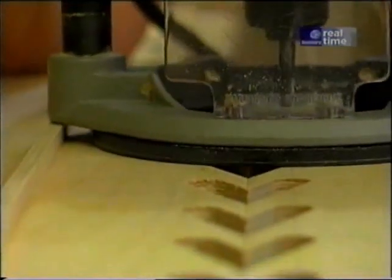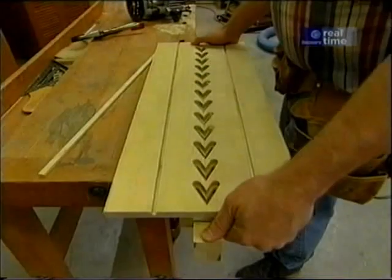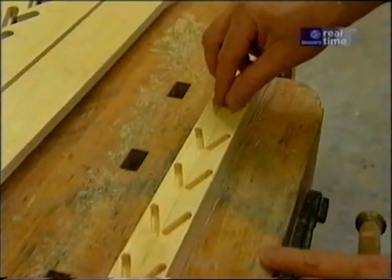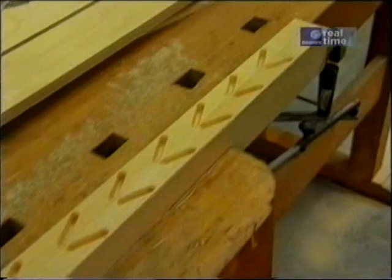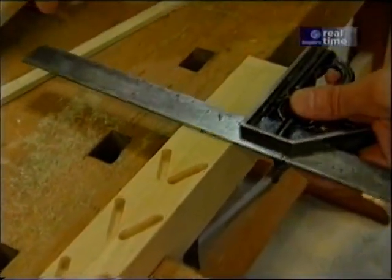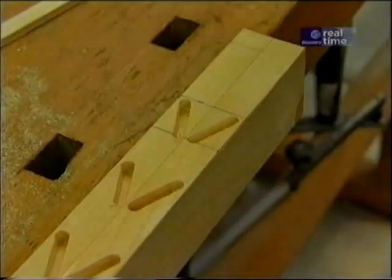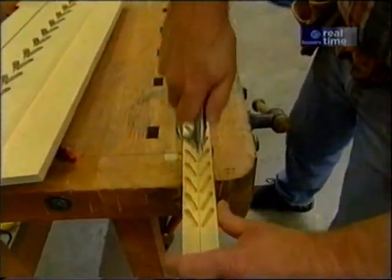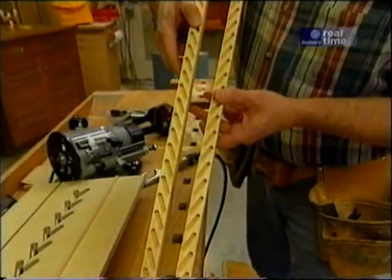Now I'll move the stop to the other side of the jig and route the corresponding stile. I can pop off the jig and you can see that I have mirror-image slots for the slats every two inches. What I want to do now is put a slot every inch. So I take my square, which is one inch wide, go to my original mark, move it up an inch, reset the jig, and go through the same process. And there you have two perfectly matched stiles for louver slats.